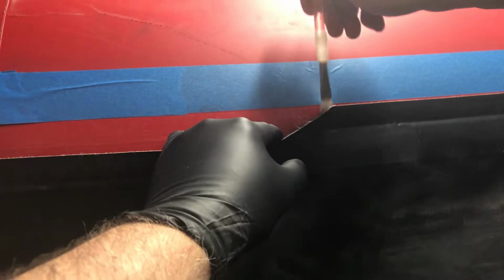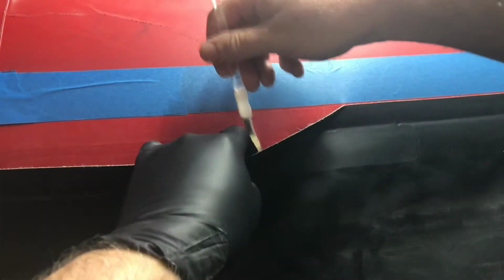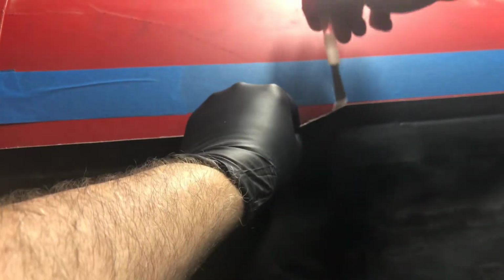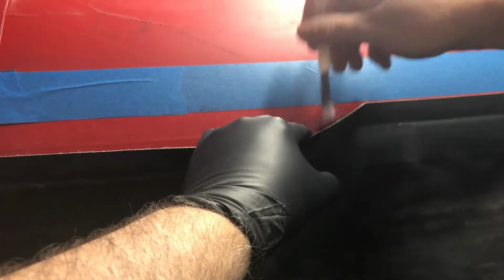You can actually see every now and then on some of the pieces the pencil marks that Zodiac put on it when they assembled it. I think this hull was made in 2006. I'd have to look at the hull plate on it, but I think it was 2006 that this Zodiac was produced. So that maybe gives you an idea how long PVC glue will last. If you've got a 10-year-old Zodiac, you could be expecting to take the whole thing apart and re-glue the sections again.